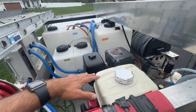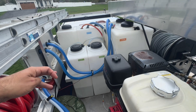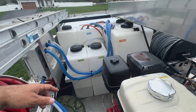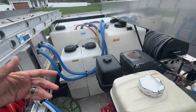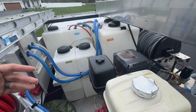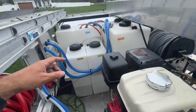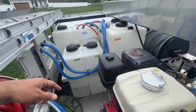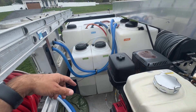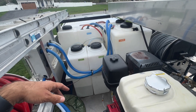If you've got one of these commercial-size machines, there needs to be a buffer tank in between. I've seen a lot of bad advice online — people saying you've got to have 300 to 400 gallons of water in your truck and you've got to carry it with you everywhere. Not necessarily, unless you're working way out in rural country where everybody's got a really bad well and it's in your business model to carry your own water — then go ahead. But I wouldn't put it in the back of a truck. This is a three-quarter-ton heavy-duty Chevy 2500 — they're made for 1,500 pounds in the bed. 100 gallons of water weighs over 800 pounds alone. Water's eight pounds per gallon. I'm not carrying anything I don't have to. That's all a waste.